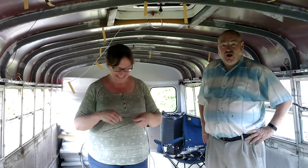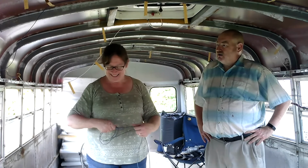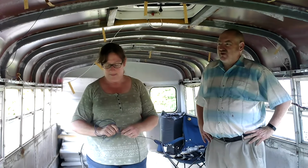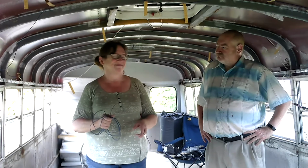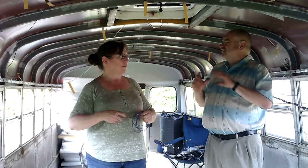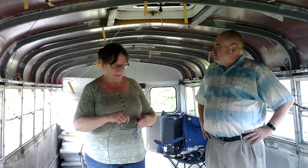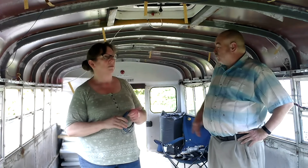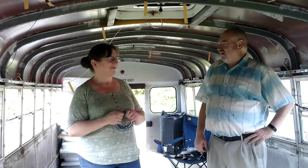Okay. So I hope you got something out of this video. This wasn't a difficult step in the process. It was very time consuming. There were over 1,000 screws in that. It was difficult, and you needed a lot of muscle. Getting that angle and the leverage. And definitely using the square bit instead of the Phillips made a big difference. And we'll actually repurpose some of those screws when we attach the sheet metal on the outside over the windows. So again, it wouldn't be prudent to throw it away and then buy new.